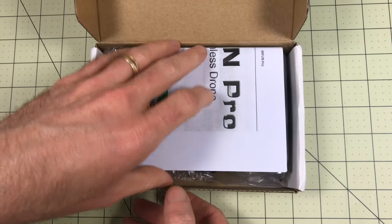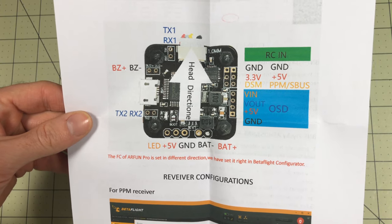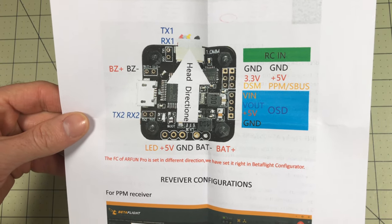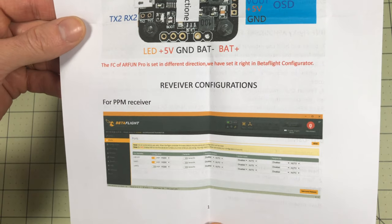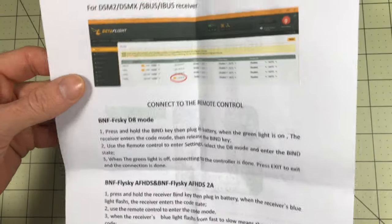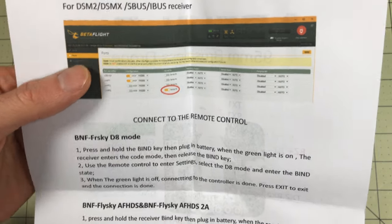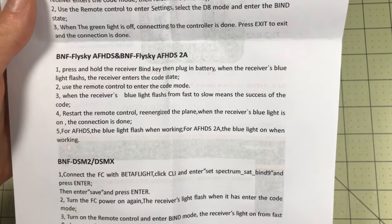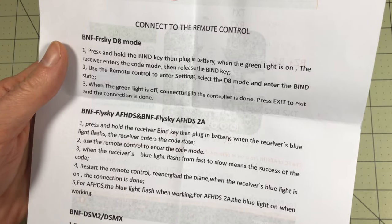The manual is a single sheet of paper, at least printed in color, so you can tell the directions. We have the essentials, but you have to know what you're doing. If you're a PPM receiver - which I hope not, because we should be serial - there are the instructions for hooking up your own. For any of them that come, it should be on UART 3, which is pretty standard, and then instructions on how to bind.